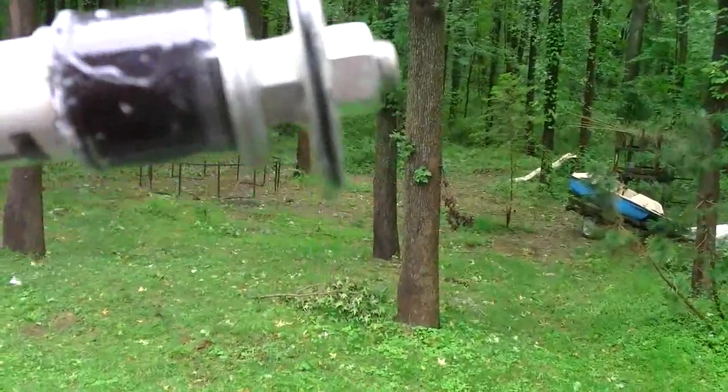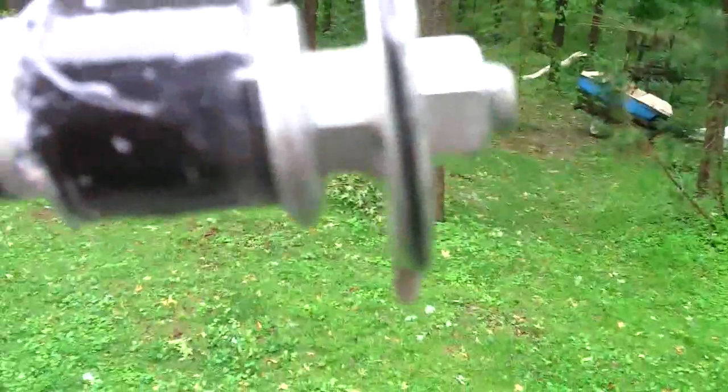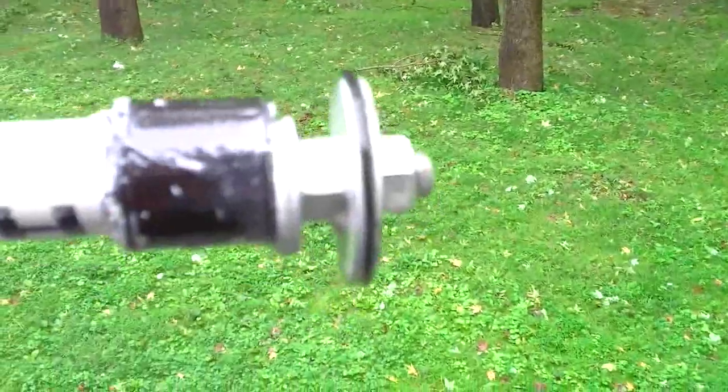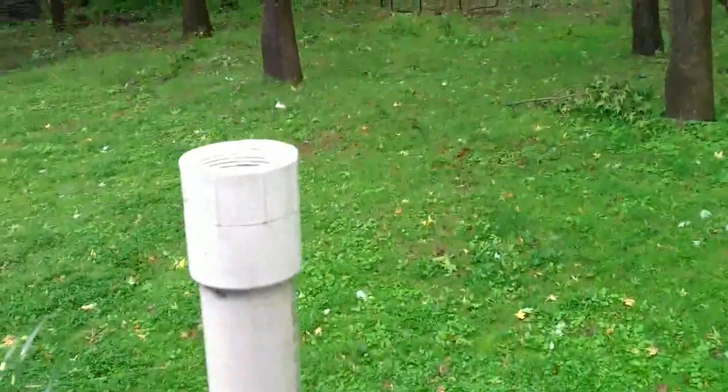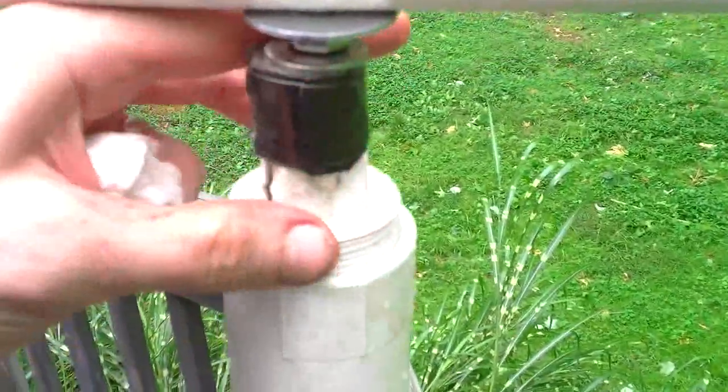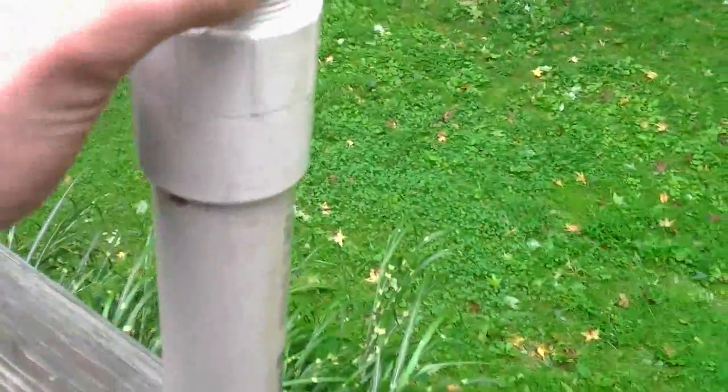Then here, I just have a couple washers here to make it so that I could still have access to this nut right there. A couple washers with a PVC washer in between squeezed together for the gasket. That's it, and then I put some Gorilla tape there and here as sort of shock absorbers so that if I go to the end of it, it doesn't slam into the top. And you just make it so that it has a snug fit, and then I also threw some oil down in here just to make it slide against the tube even easier.